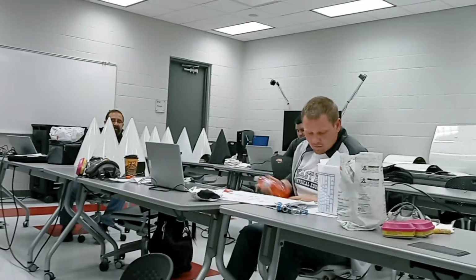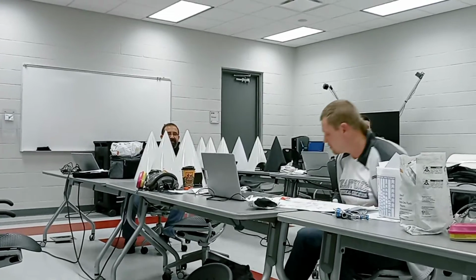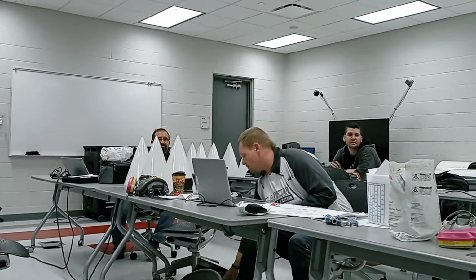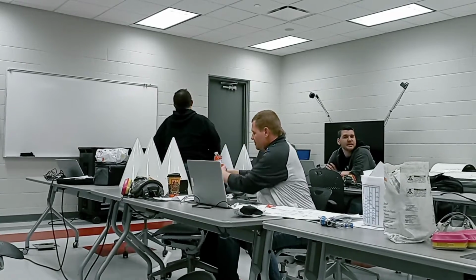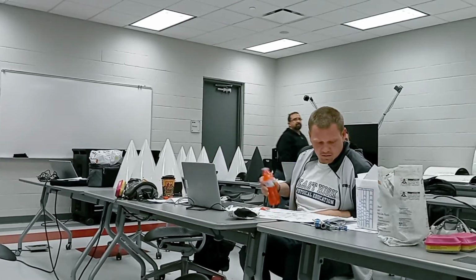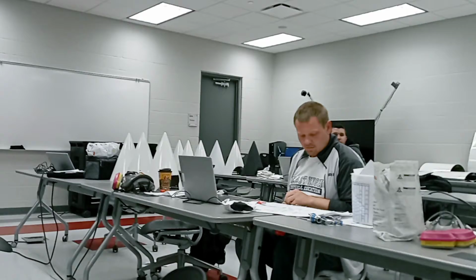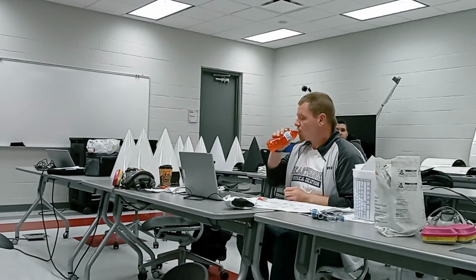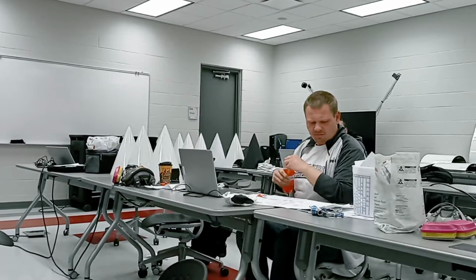Curing and drying mean the same thing. True? No, well, curing, no, it's false. So why do they say cure slash dry? Is it one or the other? Yeah, it could be one or the other. So remember, drying is the evaporation of solvents, and curing is the evaporation of solvents and a chemical reaction that is happening within your coating.